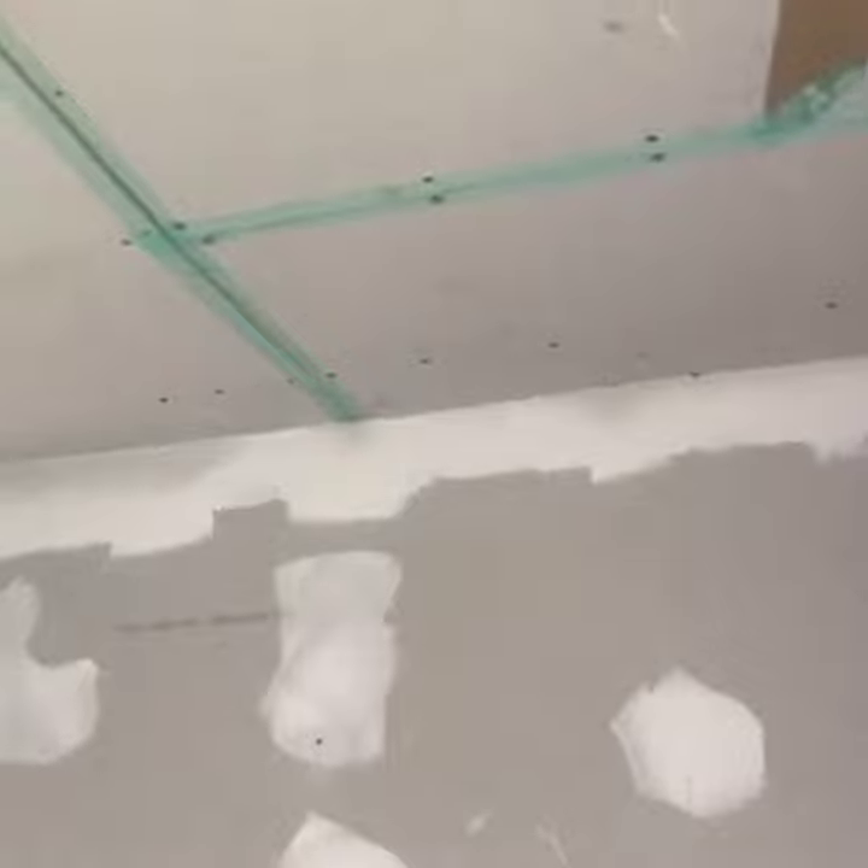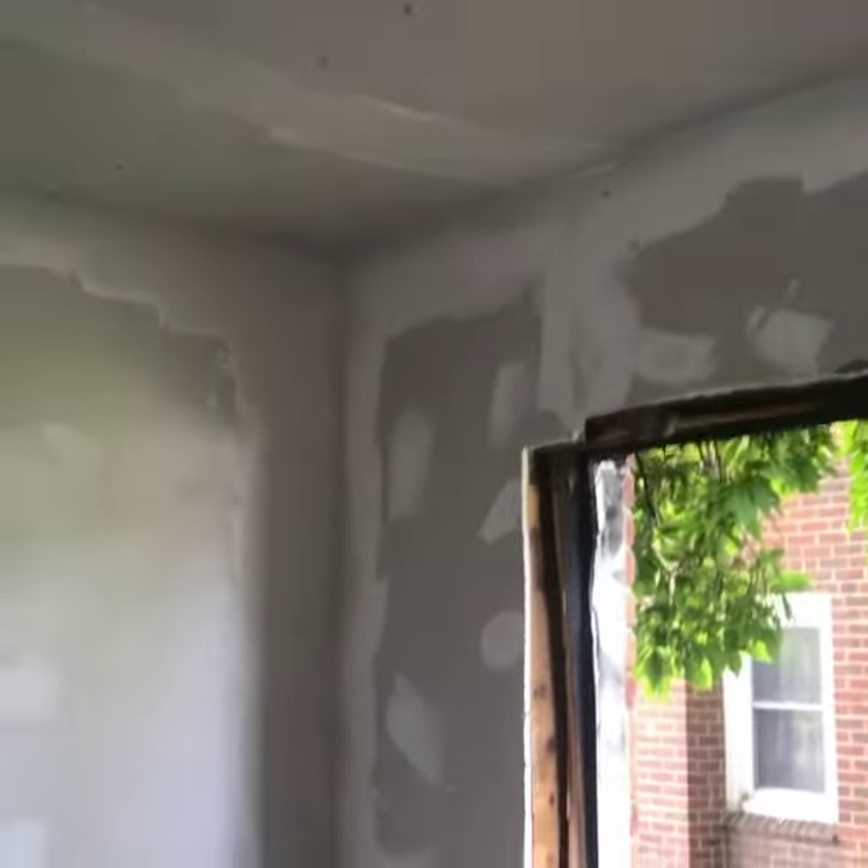It's a new day. Been in here since this morning. It's that room that had all them gaps in there. I'm having to spread the mud out so wide and thick to fill it. Remember them gaps? Those were big gaps in there, so I put the mesh tape up there.